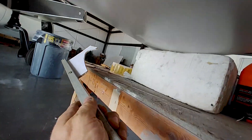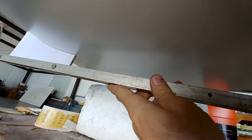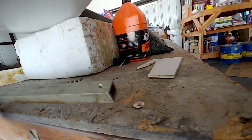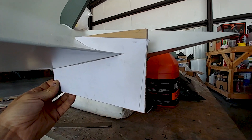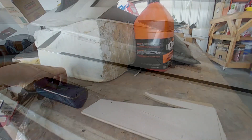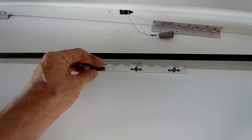There's my little template, bolted onto a three-quarter-inch square tube. It sits so that the top edge is basically aligned with the chord line of the foreplane, and that way we know it's at the right angle when we set it on the fuselage.